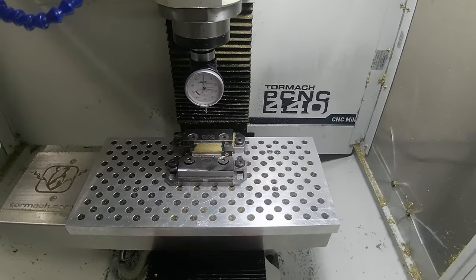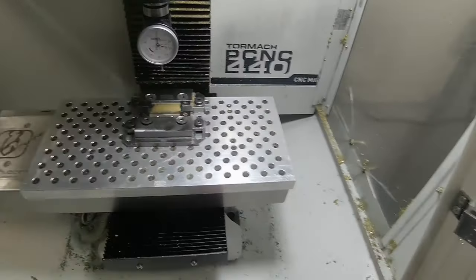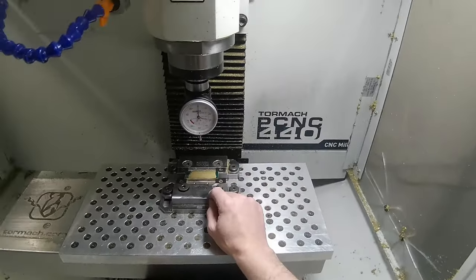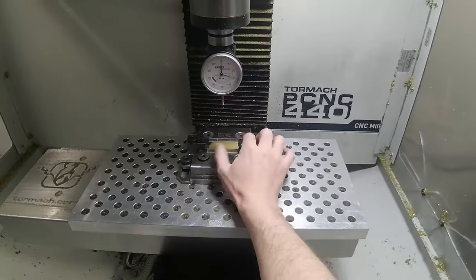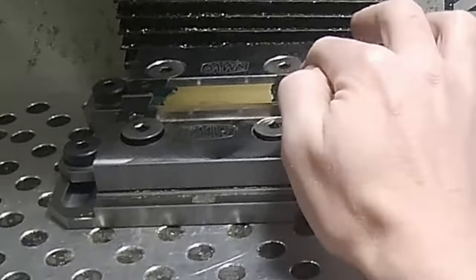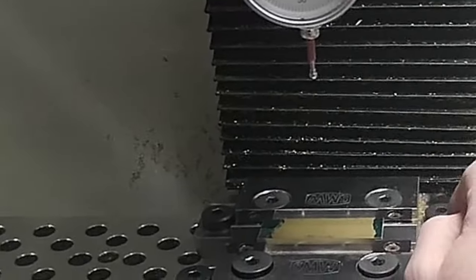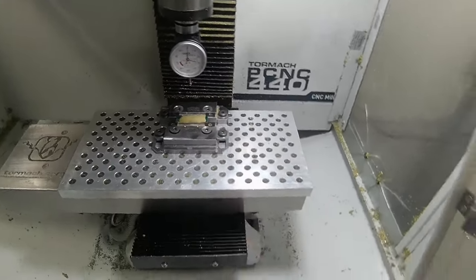It just makes so much sense. It takes a little bit longer because you have to move pieces around, so maybe it adds a little bit of time to the setups, but I think it's a lovely system and I've always been very happy with it. You can get different clamps and teeth. So if you're going to get a Tormach, I would recommend this system for the type of work I do. The work is touched off, the depth is 31 thousandths, and the depth between the top and the face of the jaws is 50 thousandths. So there should be 20 thousandths of clearance between the cutter and the face of these talon grips.